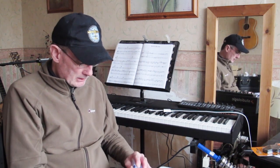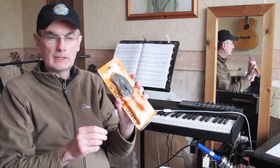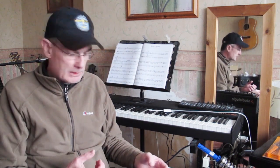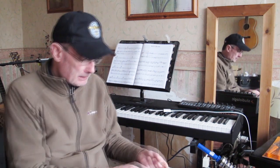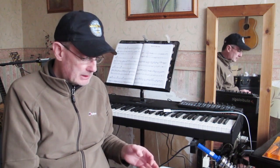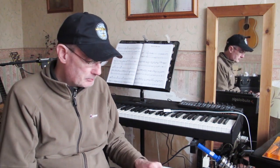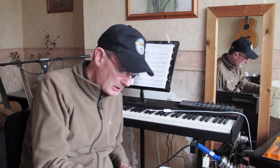So we'll make those crimp terminals — I've got a crimping tool here. We'll be able to take the panel away from the computer, detach the board and the board umbilical connection, and then detach the Arduino umbilical connection. It's a bit complicated, but it's a much better solution long-term than just sticking wires directly into the Arduino — that just leads to no end of heartache.